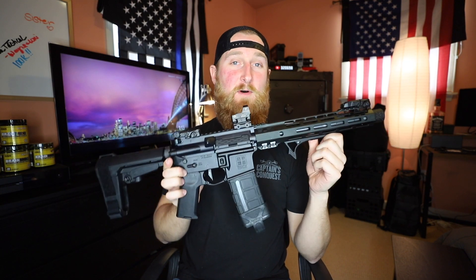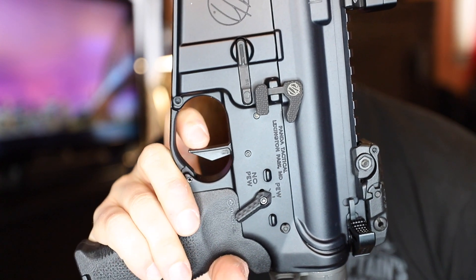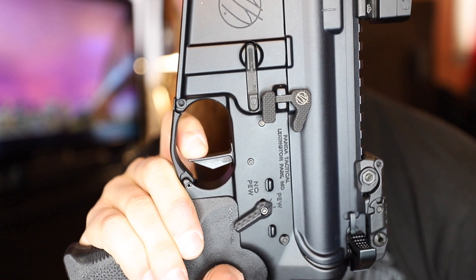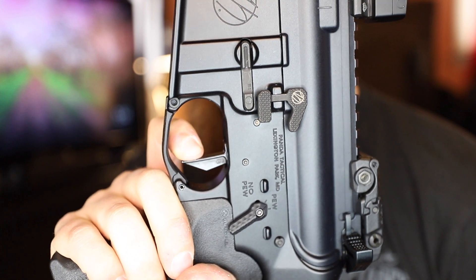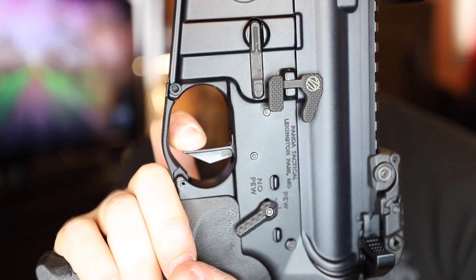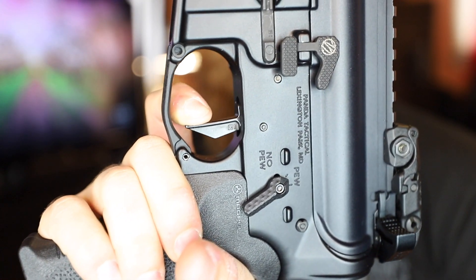Back for some final thoughts on this version 1 of the TS Panda build. One thing I'll hit on quick is this trigger — it is exactly the same as the one in the Atom Smasher, so I've already given my thoughts on it, but here we go again. I love Geissele products, including these flat-face triggers. If you have your finger up high you'll need to apply a little more pressure, but down lower you get more leverage and a lighter pull. This is a two-stage trigger — pull it back and you'll get right to that wall, super defined. It's about a three and a half pound pull, super crisp and clean break — almost like glass breaking. Reset is nice and short, super tactile and audible.